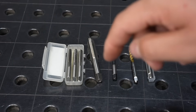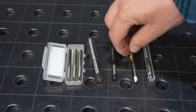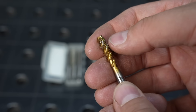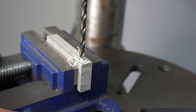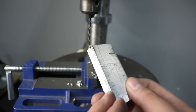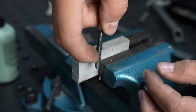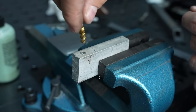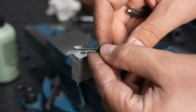What if you have a blind hole and don't have room for that chip to go down through the bottom? That's where this comes in — this is a spiral flute tap, and you can see that the flutes are spiraled just like a drill. If I were to use a spiral point tap in a blind hole, the bottom isn't cut to the full depth of thread and that chip would be stuck under the tap. This will pull the chip up and cuts to the bottom.